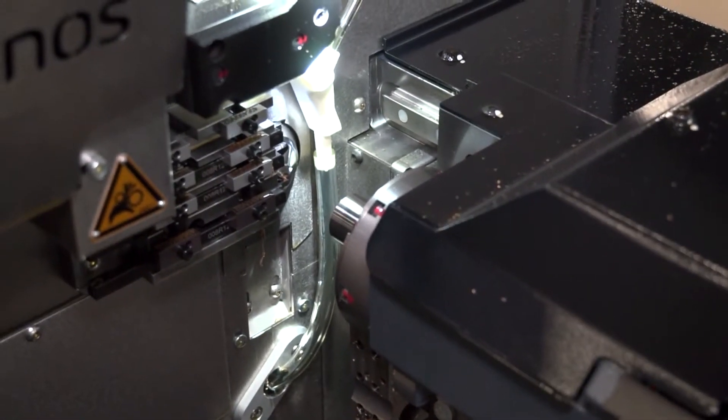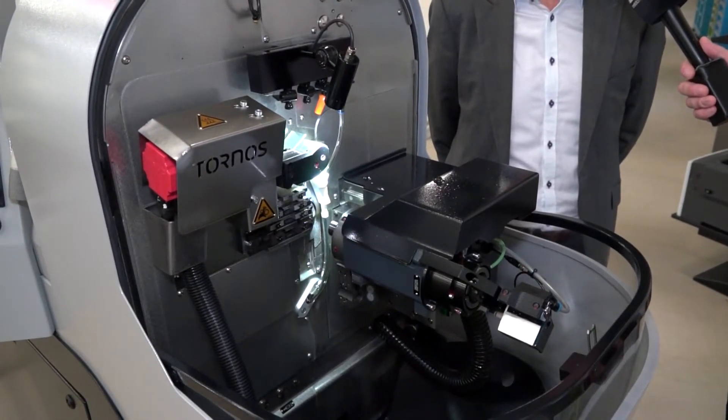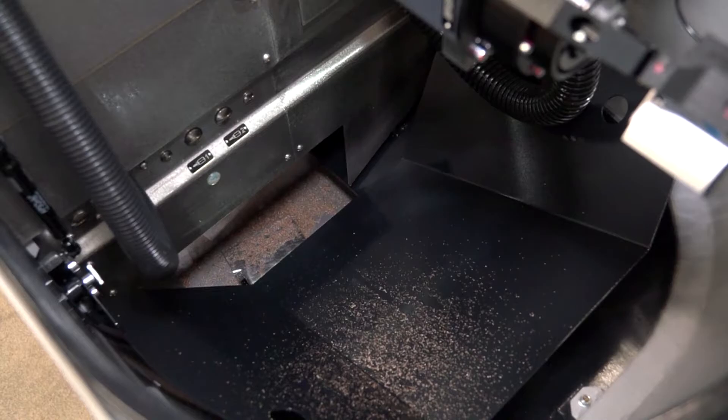When you're doing volumes of parts, time is everything. How fast is this machine — how quick does the spindle run, how quick do the axes move? The spindle rotations on the main and sub spindle go up to 16,000 RPM. We have over 25 metres per minute axis acceleration on the machine with a small axis travel distance. So it is a very productive machine for small applications.